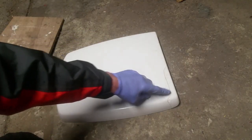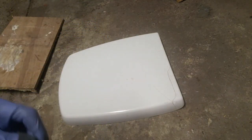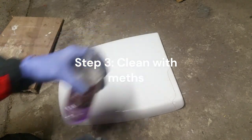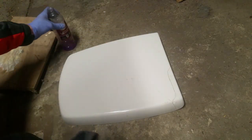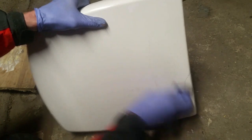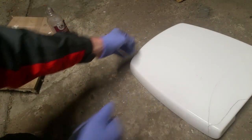I've gouged out the rest of those grooves, front and back. Now we just need to make sure it's all clean. I'm going to get a rag and a bit of methylated spirits or some other sort of cleaning alcohol. Not white spirit, because that leaves an oily surface on there. So I just rub that all down and it will evaporate within a minute or two. That's now ready for us to apply the epoxy.